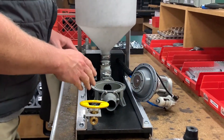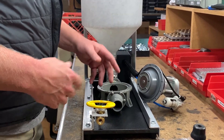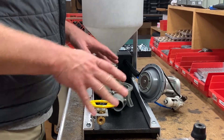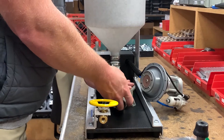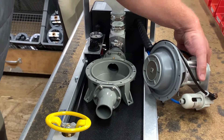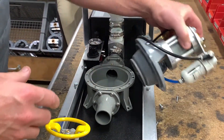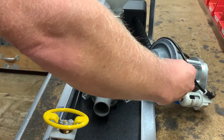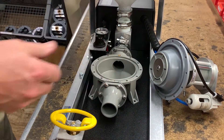Now we want to get to your flapper valves. Some people change just their diaphragm and do the flapper valves every other time — that's your prerogative. I say change everything at the same time. If you don't want to change your flapper valves and they're still good, just come back and put the top part of your pump back on, then mount your cap screws and make sure everything's tight.